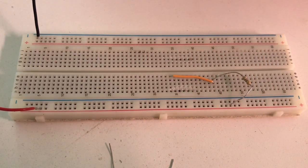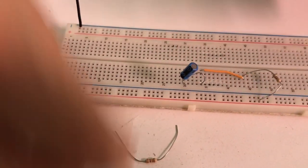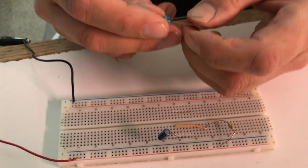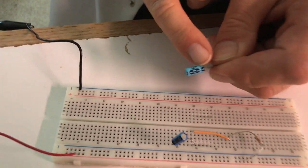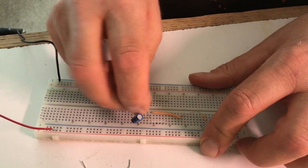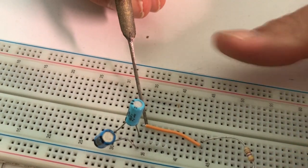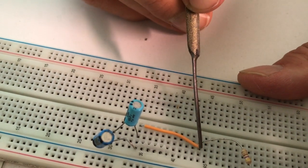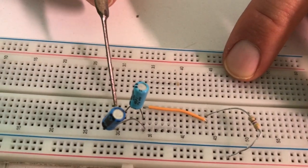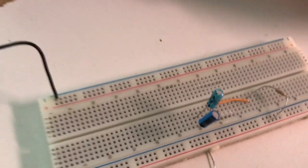From here I need to break out and go into two capacitors in parallel. I'll do this and that - and grab my other capacitor and put it here and there. These are one-microfarad capacitors. The negative leg is the one with the black stripe. These are polarity-sensitive so I'm hooking them up properly. This row is all connected, so this leg and that leg and that leg are all physically connected to the same point. Now I'll get a dark wire and go from here over to ground.